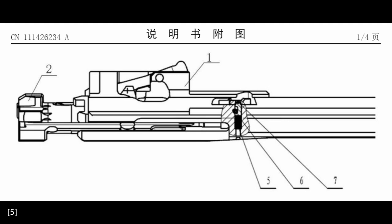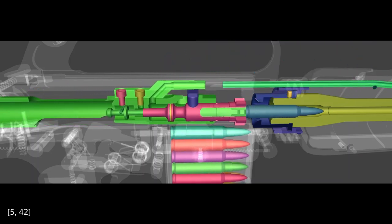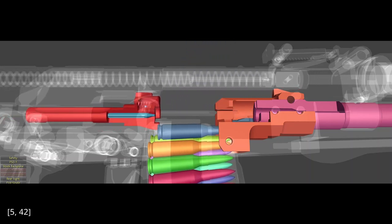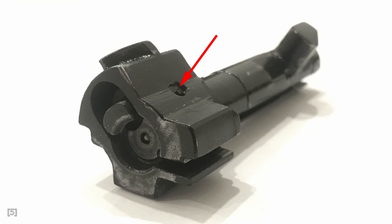The next patent is for the improved firing pin retaining pin. As described in the document, traditional AR-15 cotter pins can be easily broken or lose elasticity over time — if this happens, you risk losing the cotter pin when you take the bolt carrier group out of the upper. However, the benefit of the AR-15 style firing pin design was also stated: the firing pin travels with the bolt carrier, so if the gun slam fires, it would do so when the bolt carrier has reached the frontmost position, meaning when the bolt has locked. Conversely, on AKs or on their previous service rifle the QBZ95, the firing pin travels with the bolt, so there's a risk the gun will slam fire before the bolt is locked. The roll pin that retains the firing pin on the QBZ95 is also harder to remove for maintenance, and if removed and reinstalled multiple times, it can lose elasticity and work itself out of the bolt during use, causing a serious malfunction.